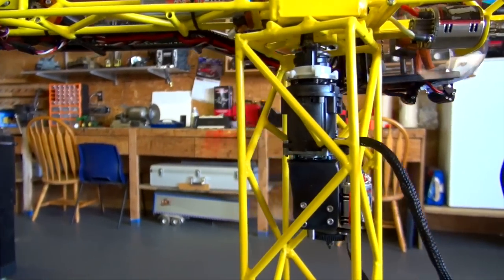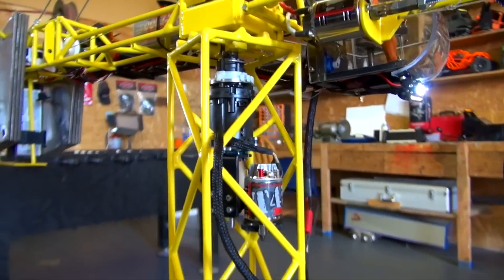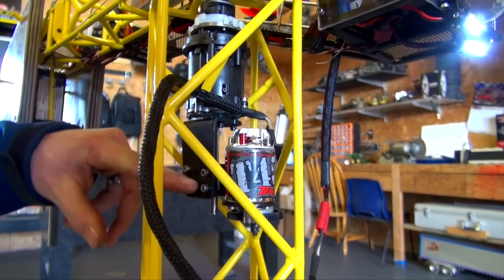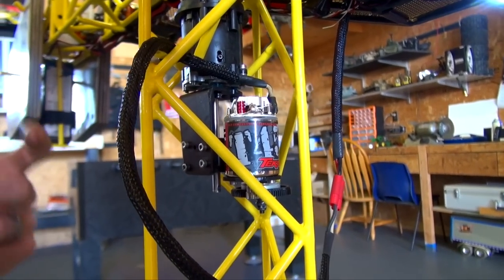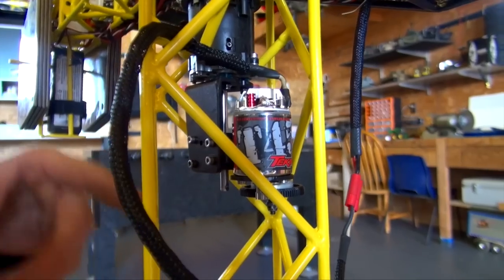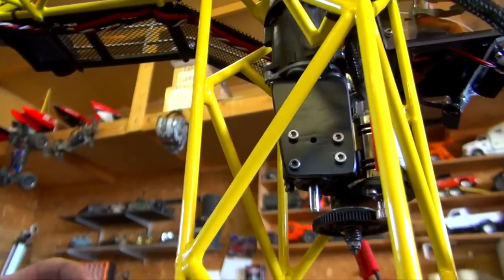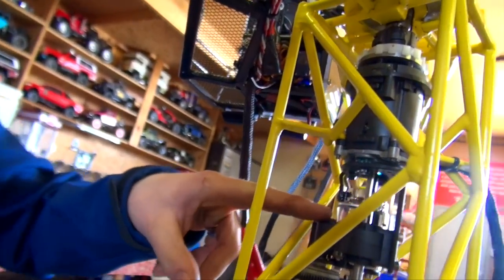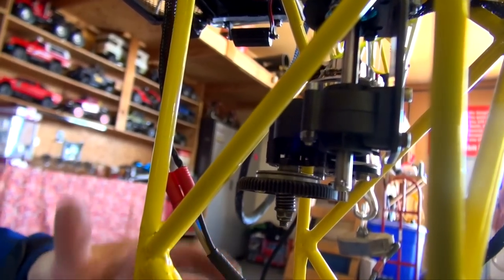Focusing on the middle part — the DeWalt transmission. Originally we had the DeWalt motor mounted right in here. It was a five-slot big brushed motor — lots of torque, lots of control. Whereas most of the RC motors we run are three-slot. So what I went and did was take an Axial transmission. This is also a cheap mod you could do to your stock outputs to make them stronger — or upgrade to six-millimeter outputs. You take the stock cast aluminum outputs and drill them out.